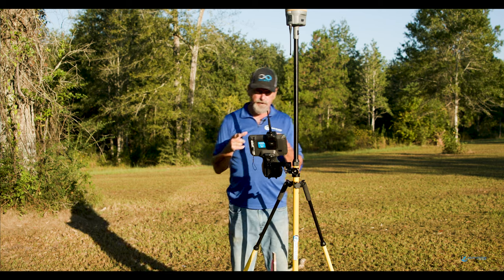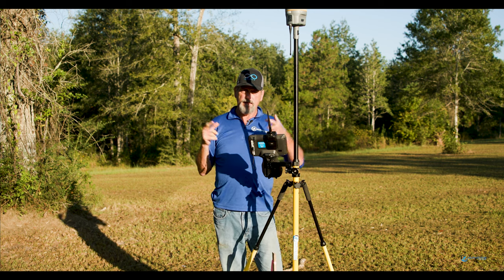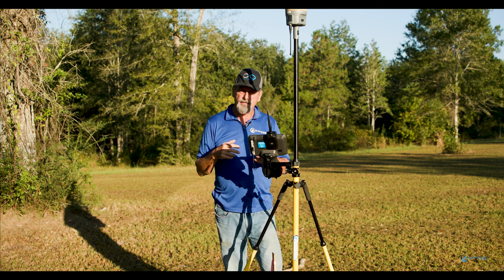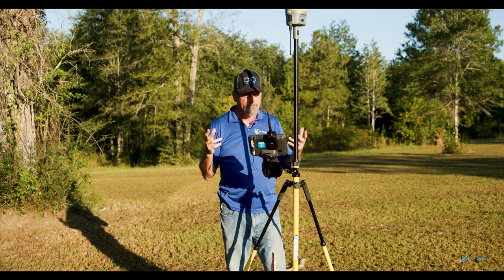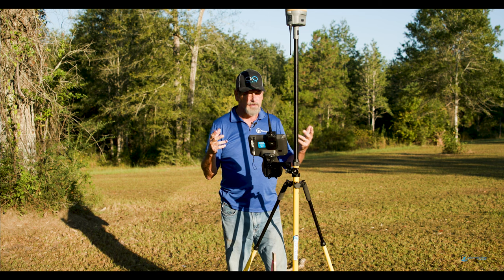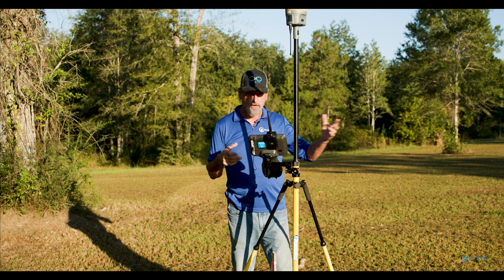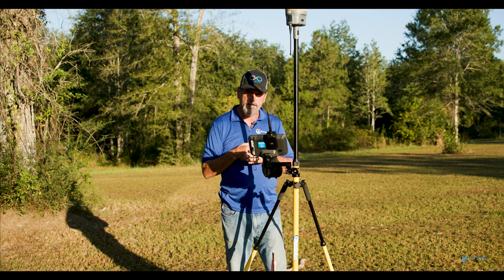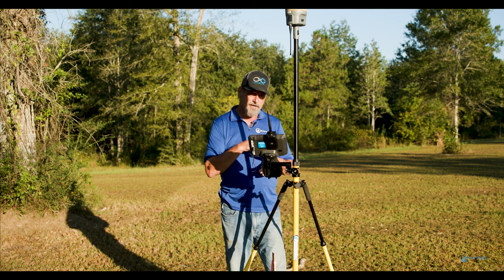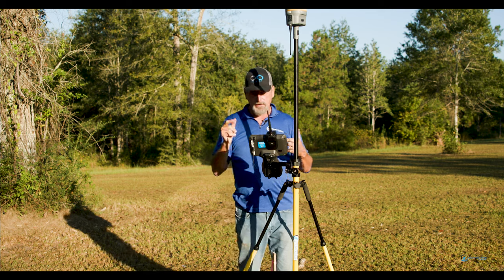Now here's a little secret for you guys. 180 epochs does not mean for 180 epochs it is averaging the points. What 180 epochs means is you're static for 3 minutes and it's going to take the last shot. I thought it averaged it, got to admit, but when I was talking to some guys from Trimble, they're like, nope, it goes for 3 minutes and basically you're static during that period of time. So theoretically, by the time you get to the end, whatever the number is what the number is, and then you're going to store it.